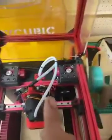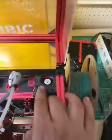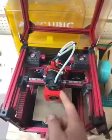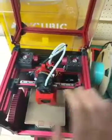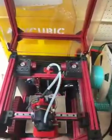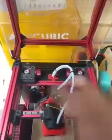And what you should find, if it's done correctly, is that you should have proper tension with the belts and the bolts in the exact same position. Because if they're the same length and you have the same number of teeth on each side coming out before you cut them, it should be perfect. And if you're not racked mechanically, everything should be square, right? Because if you're racked mechanically, you're obviously not square. So there we go.